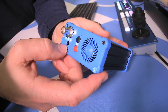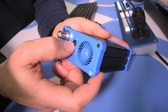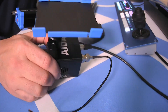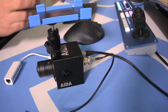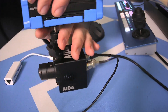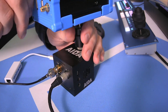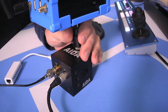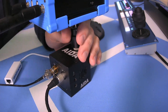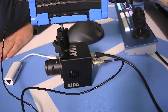It's got a power button, a power port that takes a wide range of voltage, and then it looks like it has a button here to start and stop streaming. It also comes with this mounting plate which snaps onto the unit, so we can just pop the unit in and now it's mounted on top of our camera. All we need to do at this point is attach some of these included Wi-Fi antennas and the SDI, and we will have our NDI wireless kit ready to go.